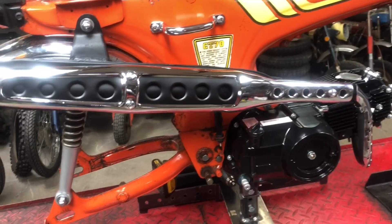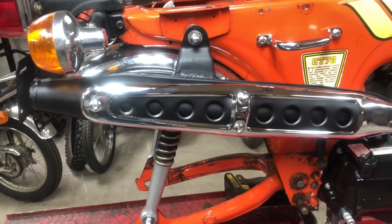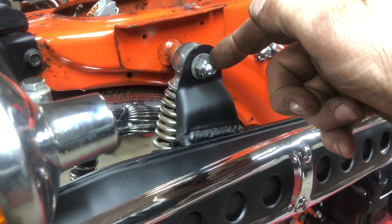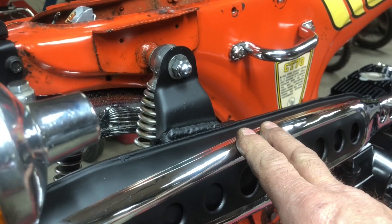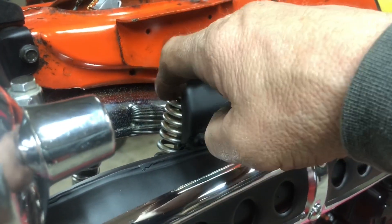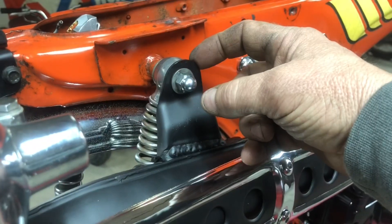All buttoned up and put back on the bike. If you go that route and need to change that mount there on the shock, that's kind of how I do it — I think it looks the cleanest when you're done. Now, one thing: if you use these exhausts and put them on an early bike, remember to take out the little spacer that is bolted on — like the K0s, K1s and so forth up to '76 or '77. This bracket was straight and there was a little spacer bolted onto that stud to space the exhaust away from the shock. You don't need it with this little dog-leg bracket. I get guys that message me asking why the exhaust sticks so far out — well, that's because you've got that extra inch and a half spacer in there.